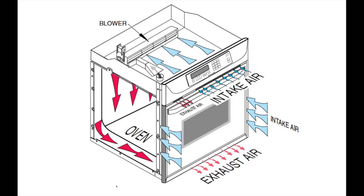Air management is a huge engineering challenge. Cool air is drawn past the sense electronics to the blower, then pushed down and out. I've been calling this part the snorkel. Hot air inside the oven is given a passageway to escape — it gets to a T intersection and is then drawn either through to the blower or goes directly out through the exhaust. When the oven is on you should be able to see it coming out here.